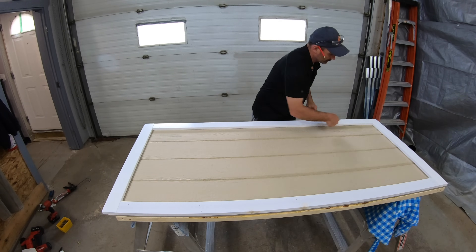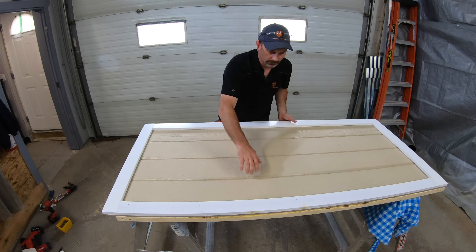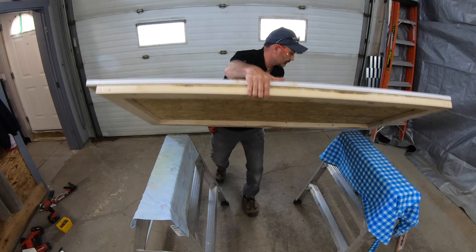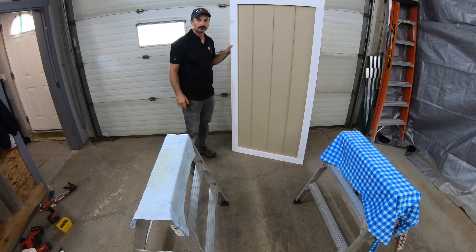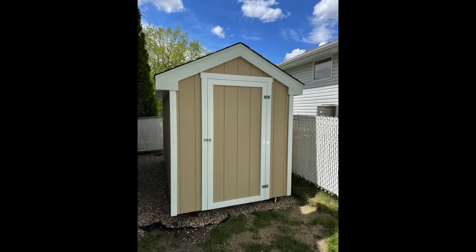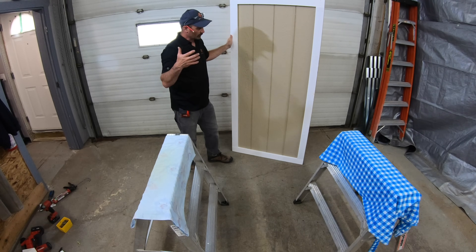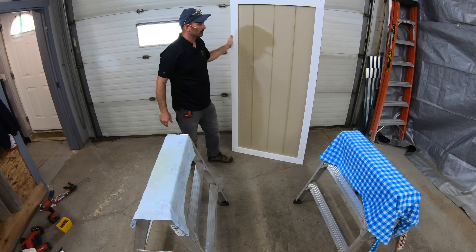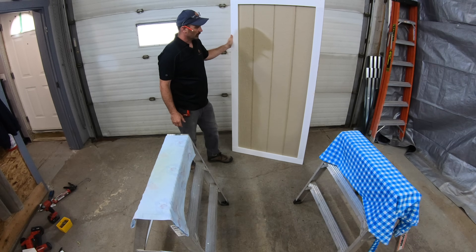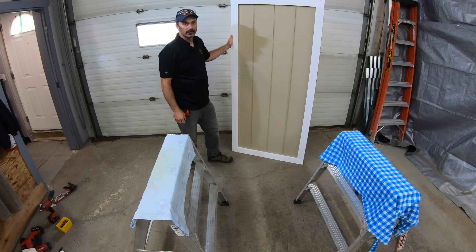You can also put a bead of exterior grade paintable caulking along the inside of all the trim pieces to help shed water from going behind the trim. Other than that we're pretty much done — let's stand it up and have a look. Hopefully you found this informative — a quick, simple, easy way to make a shed door without costing an arm and a leg. In my other shed series I used a metal roll-up door which is pretty costly, and this is a much cheaper alternative. Smash that thumbs up button, subscribe to the channel and check out all our other videos!